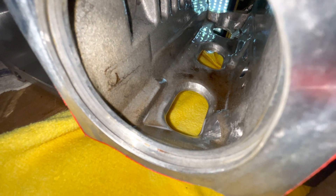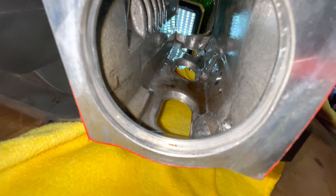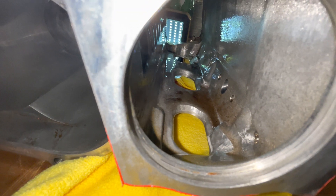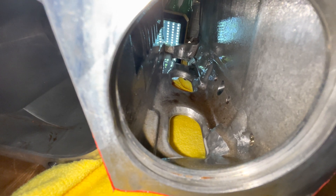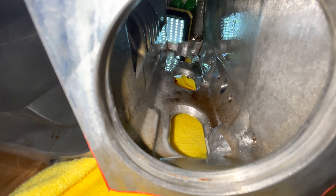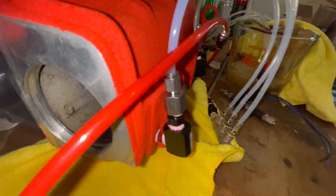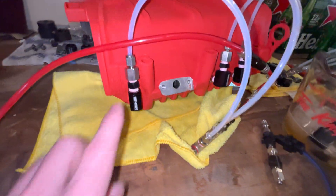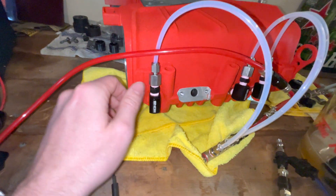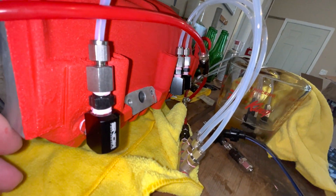When I was porting I kind of tapered the area so that it can drain down - so the nozzles are right there. They do look like they're recessed a little bit but they're not, they're flush. That's probably just some shiny ones on that front one you see on the right there, but the rest are all flush with the material. There's about five millimeters of material thickness for the case - some areas were three. This one I had to grind down this little hook that's usually here, and then drill through and put it in. The other ones I had to take off material - so I basically just followed the channel itself where the bolt goes and ground it right down to the casing.